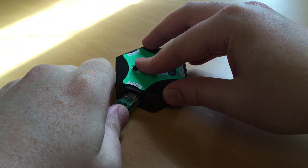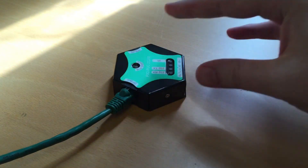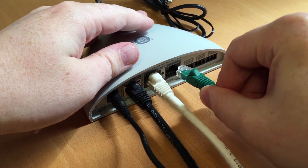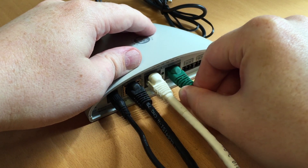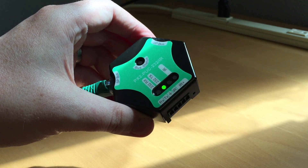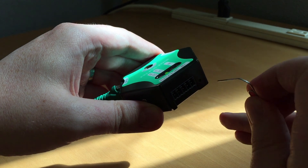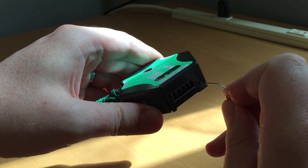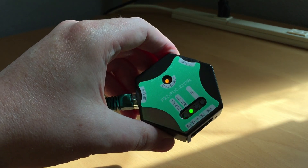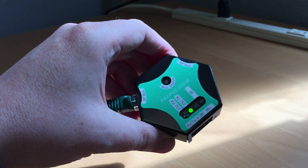Connect the CAT5 jack to one of the SP bus ports on the puck, and then connect the CAT5 cable to the other SP bus port on the back of the NRC. Like the Pixi Pro, you will need to announce the puck so the NRC is aware of its existence. To the right of the Phoenix connector on the front of the puck, you will see a small recessed hole — insert a paper clip in this hole to announce the puck. You will see the light flash orange once per second.